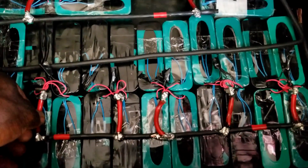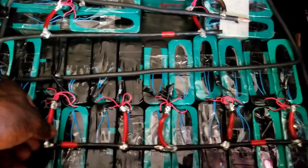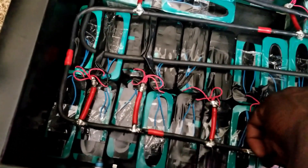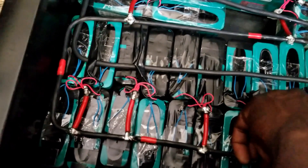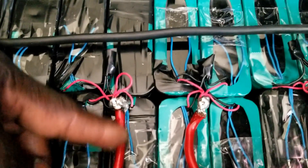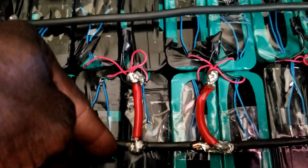It's not going to be stressed because these ones are flexible instead of a solid four gauge wire which is tough. I created flexibility for movement — if you're transporting it and it's going to have some vibration, instead of putting stress into the battery where it connects to the BMS and breaking, because these BMS wires are like 22 gauge, they are smaller wires. So I paralleled them all to beefy solder so that transferring power is not going to be any problem. This connection right here is number six gauge, then it comes to the main bus which is number four gauge.